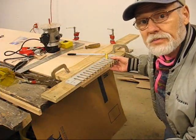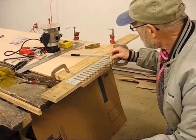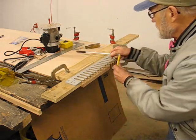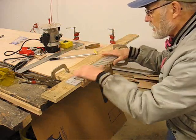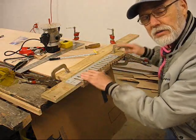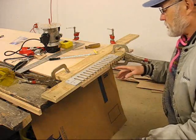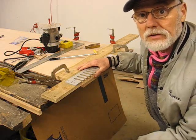Well, I had found something in my toolbox that was a perfect half inch thick. It was the end on my magnet extension, which is just perfect, and it's nice bright yellow, so it gives me that tool look. So that's in there, no movement, great. I got it clamped down and screwed down. That's the only problem with having this shorter. If it was a longer finger bar, then I wouldn't have to do a setup for each move over. So I've got to go back over to the spiral cut bit again, and we'll come back when we do that.